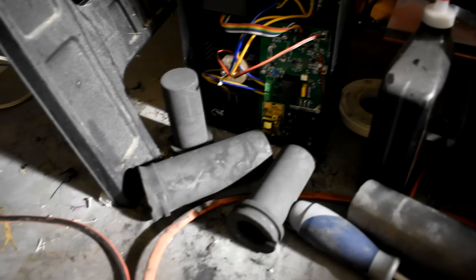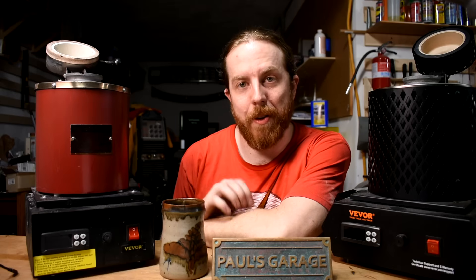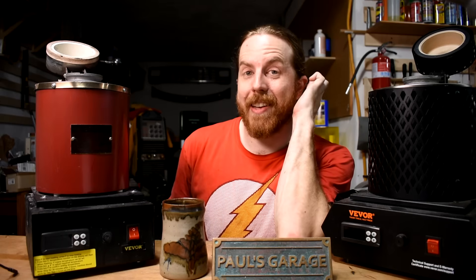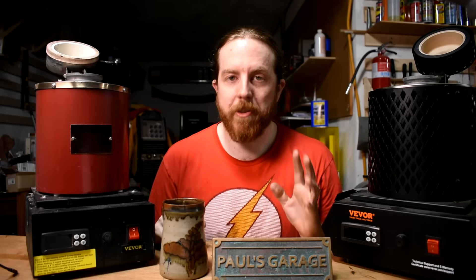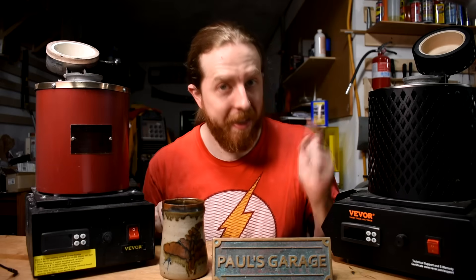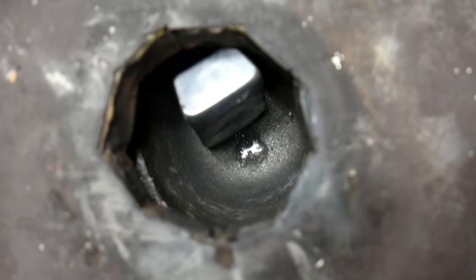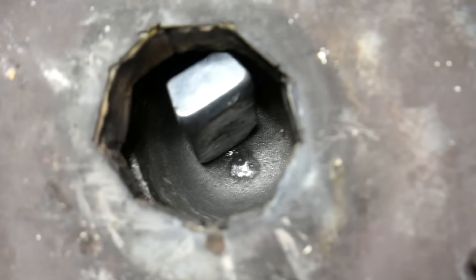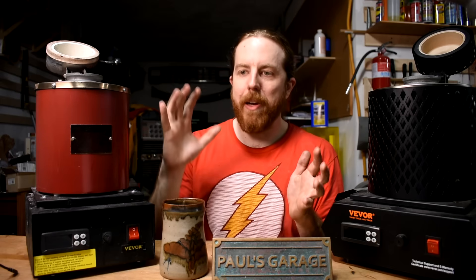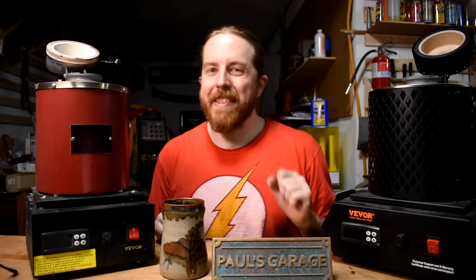And in fact, going and checking right now — that's not good. I should probably put that back together. There are three of them laying on the ground. About that concrete: there's a problem with storing things on concrete. Even dry concrete isn't dry — there's moisture trapped in there, and letting things sit on top of the concrete can make them absorb water up through the base. I have actually seen this happen in this garage. These graphite ones are on the concrete floor too. Guess I shouldn't do that anymore.